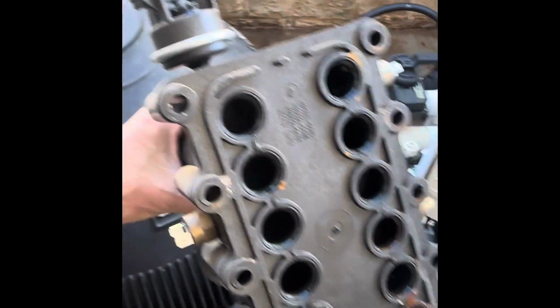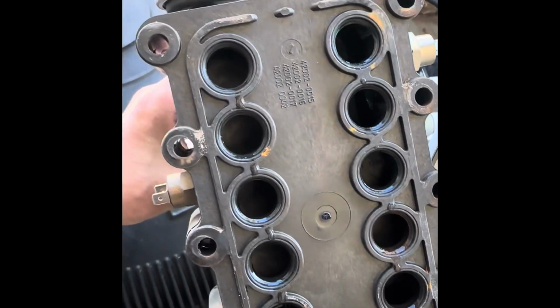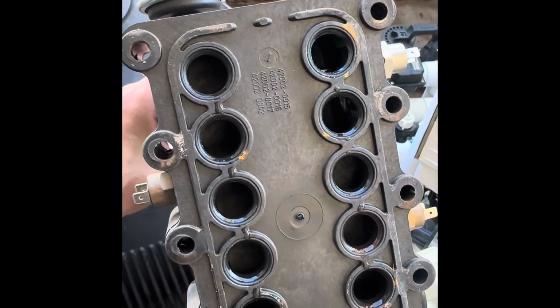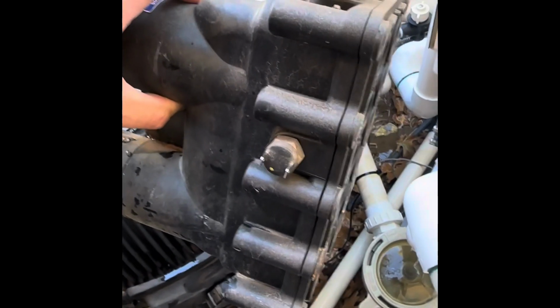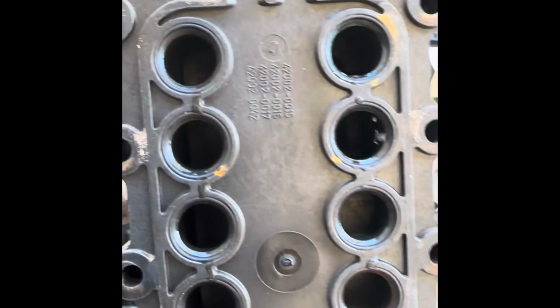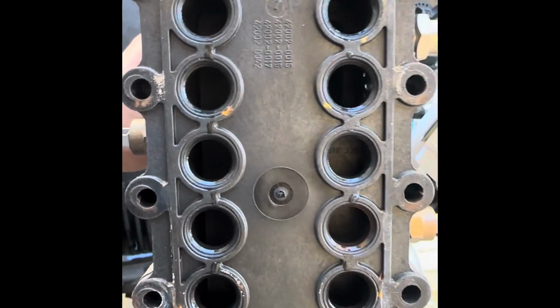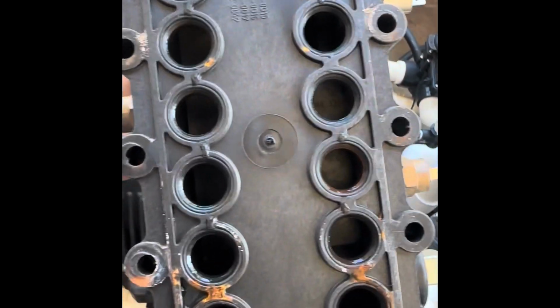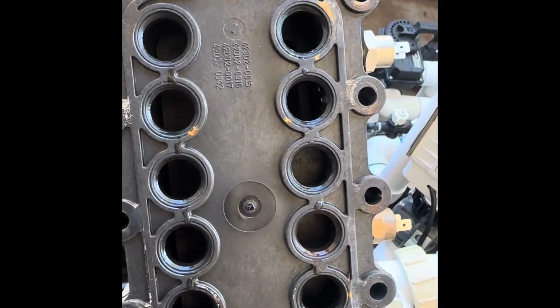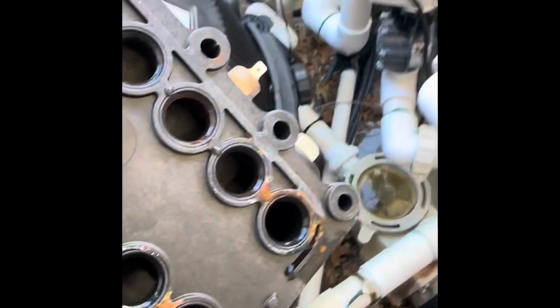Okay, and what's going on is, what's knocking in there is that bypass valve, which is inside this. You have to pry those two parts to pry the back plate off there. But we'll have to do that, and then you'll see the bypass valve is broken inside there. We'll have to clean it off, or put a new one on there and clean it off and put it back on. So I'll be right back.